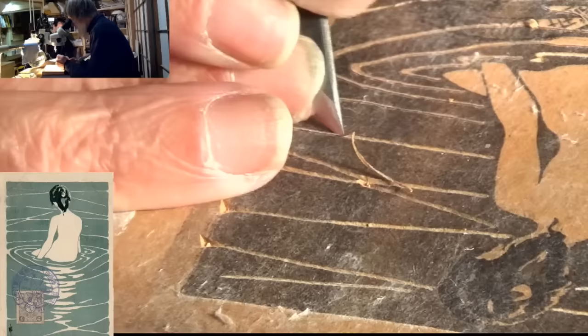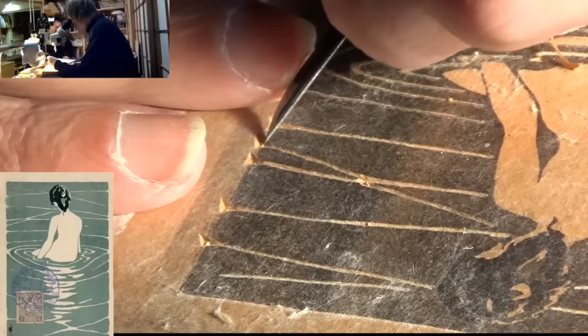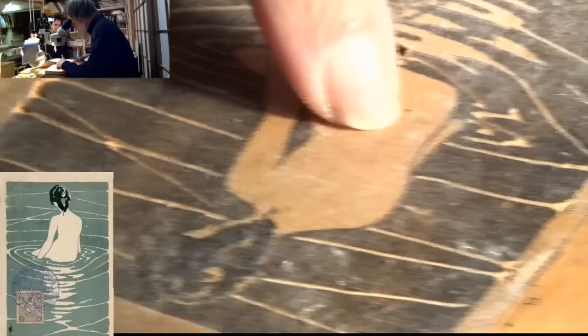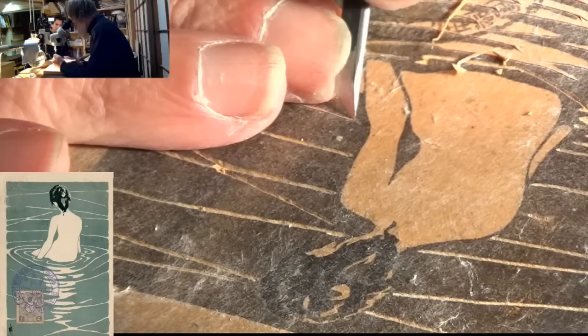How do you know how deep into the wood to cut? What is the Goldilocks zone, where it's the perfect depth? Because I know we've talked about sometimes being too shallow, sometimes being too deep. Well, the ones I'm cutting right now, they're just V-cuts, obviously. Once I get into an open area, the rule is simple: the wider the space, the deeper you go, within the limits of what you're doing. The max I would carve is 3 or 4 millimeters anywhere. These ones are just a V-cut going in, probably 0.5 millimeter down. And again, this is a question where it depends.